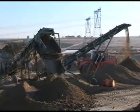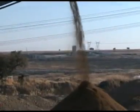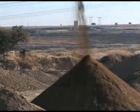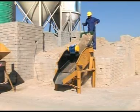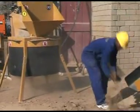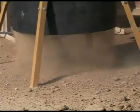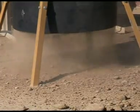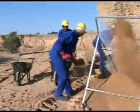The soil is now sieved, removing stones, soil lumps and large organic material. Larger industrial sieves can be used on big projects. Hydroform also supplies medium sized durable vibration screens. This sieve is used in conjunction with the Hydroform soil crusher and can reduce wastage. Sieving can also be done in the traditional way by using a fixed frame sieve with 8 millimeter wire mesh screen.